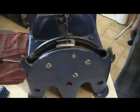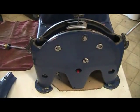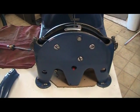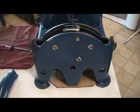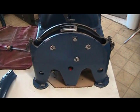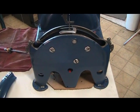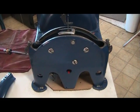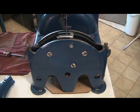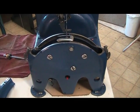Here we have a Campbell Lockstitch Machine. The arch covers are off. Before you go into this adjustment, keep in mind this is not a normal adjustment. This is something that is done after the machine has been serviced — for instance, parts related to the needle and awl assembly have been changed out, or the machine has come into contact with something hard, run across a piece of hardware, gotten jammed up, or something has caused it to be jerked hard enough to pull the head out of alignment.